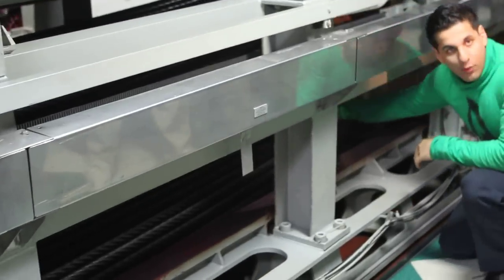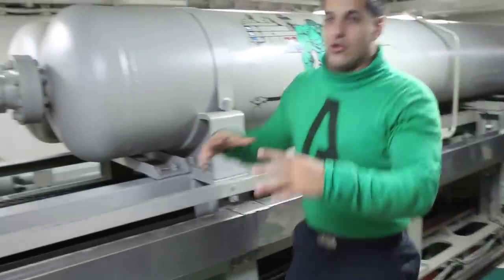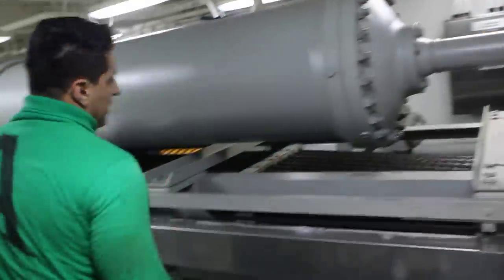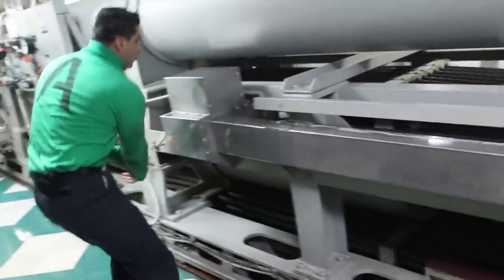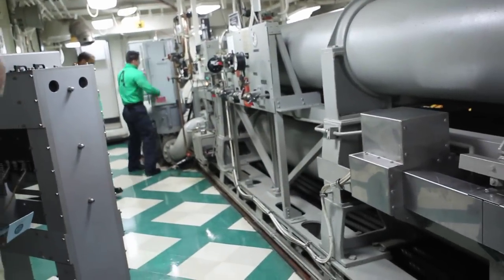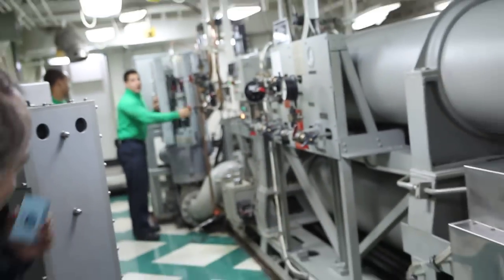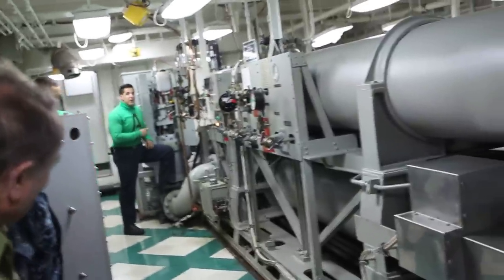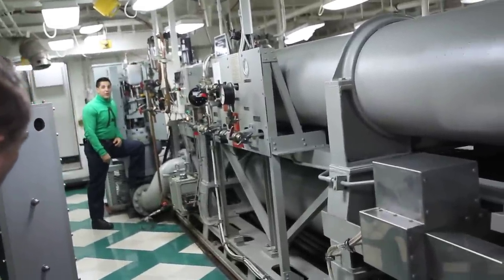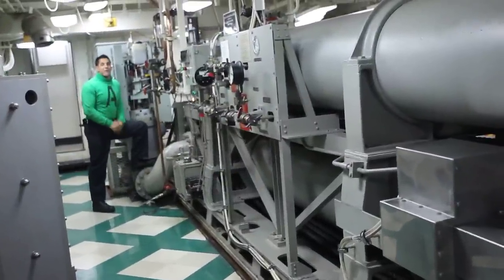As this moves, it's going to move this metal rod into a cylinder where all the hydraulic fluid is stored. When this rod pushes that fluid out, it's going to send it through this valve right here. Now this right here — this is the heart of the engine. This right here meters the flow of fluid depending on the weight of the aircraft.